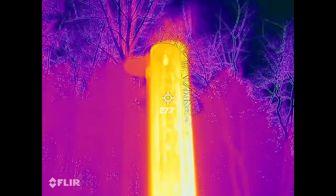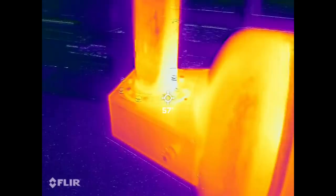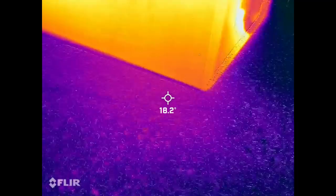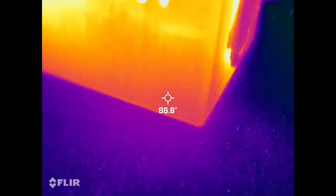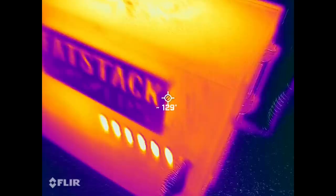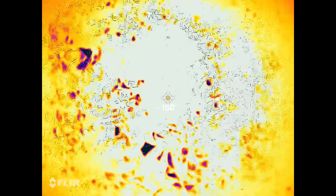Let's see if we can find anything out about this firebox. On the bottom it looks cooler — about 89 to 90 degrees Celsius. In the middle on the side, it's 100-something degrees Celsius. On the top, it's about 128 to 130 degrees Celsius. And from the top side looking down, 150 plus — so extremely hot. It's bleeding heat from the top but maintaining heat on the bottom because of the semi-insulated nature of this firebox on the bottom side. Interesting things — let's block off that stack and see what's different.